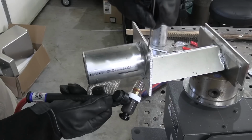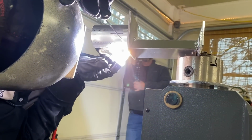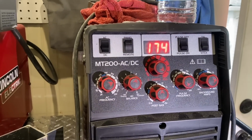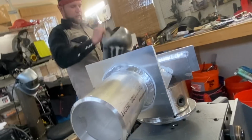The other weld we're going to test is an aluminum tube to plate in a 5F position, and my friend Andrew Carden was doing the welding on this one. This is a test he had to go certify on to make one weld in the field. And the difficulty in this test is you can't have any lack of fusion at the root. Kind of an interesting story on how and why he had to go take this test. I'll put a link right here where you can look that up and see the full video.